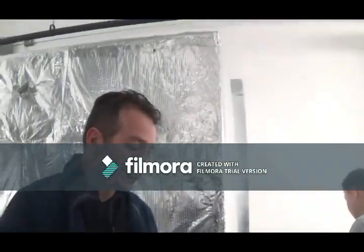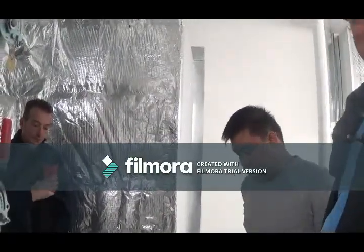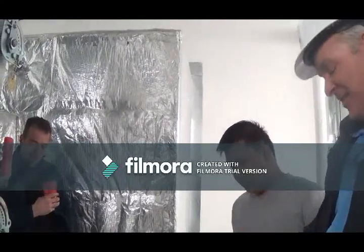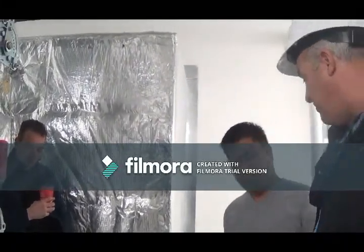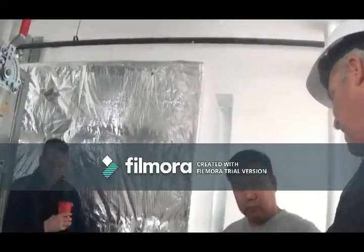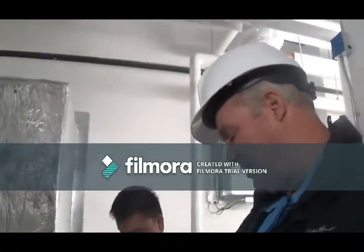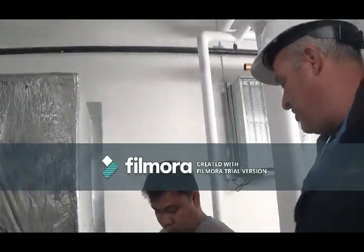What I would recommend, though, because it's going up, is that I would actually paint the floor right here. If you put a drain on the floor, it's going to be a trip hazard. What I would do is have that painted yellow on the floor so that when somebody's walking by, if there is water, they may not see the water, but they'll see the yellow, which is caution, meaning watch what you're doing, right? That's what I would do if this is to remain like that. Because I doubt very much they won't chip away the concrete to make a trough, and they should not put a pipe, as that becomes a trip hazard. So take your pick. They might put a pipe there, I'm not sure, but just leaving it like that creates a trip hazard, a slip hazard on the floor.